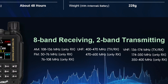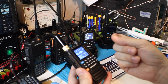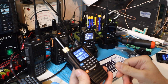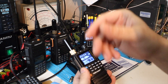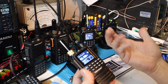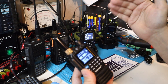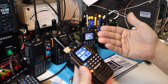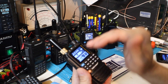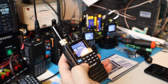The radio can CTCSS scan for the inaudible tones that open squelch — otherwise called privacy tones, which are not private at all. If your buddy comes to the camping trip with a Midland whose tones can't be changed, you have to adapt. He pushes to talk, it brings up the tone he's using, and you make a separate channel — let's call it 'goofball' — and you can start talking to him. That's menu items 28 and 29 respectively.